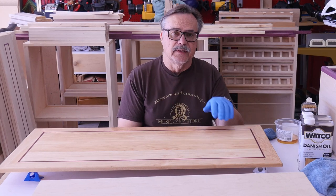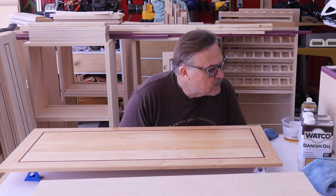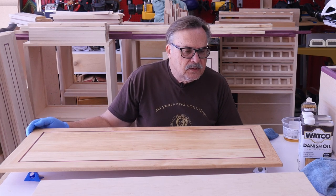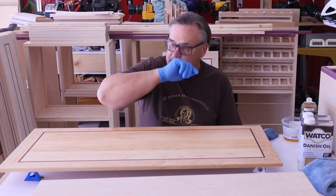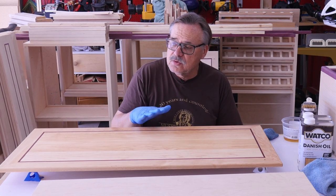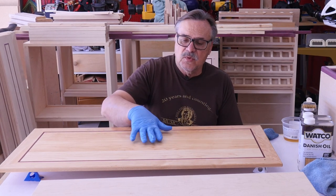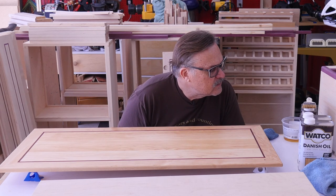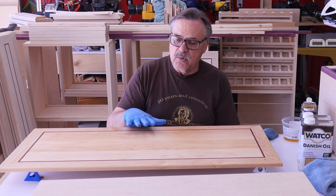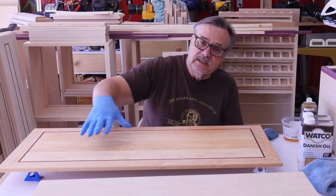Everybody always asks me what you can apply over it. They recommend polyurethane — varathane interior polyurethane. As long as you don't use lacquer, because lacquer tends to melt what's underneath and can cause bubbling. I just use it like this, but if you want a higher gloss finish you can do some wipe-on poly, which is another easy application. You want to let the Danish oil dry for a good 72 hours — they recommend at least 72 hours on the back of the can. I'd give it a week if I could, especially with porous material. I would start that 72-hour count after I was done wiping it down and no more leakage was coming up.